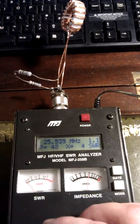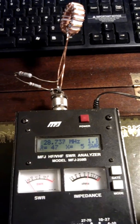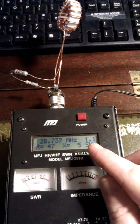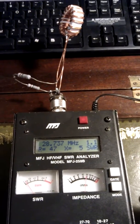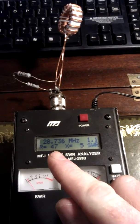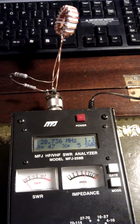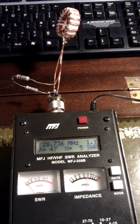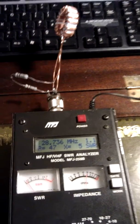Nothing to worry about. And we'll go up just touching into the 28s — there you go. We've just started to make SWR 1 to 1. It's a lovely broadband balun, and we're still only 3 ohms off of the 50 ohm target. This is 2E0VOV — very happy that I've successfully managed to build a 4 to 1 balun at last. Cheers.